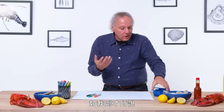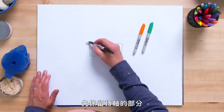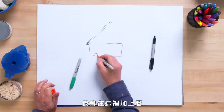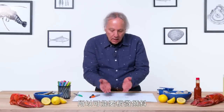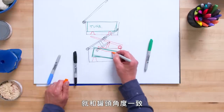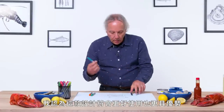Time to redesign. This doesn't give any mechanical advantage at all — you're still pushing with one or two thumbs. I would try something different: keep the hinge but design some feet to raise the can off the floor, so you can use your weight to press down on the tuna can. The water level would rise, so the design would need to be tilted. Put the hinge so that when the plunger comes down it is at the same angle as the can — that allows a palm press on top, and the liquid pools up to one side. That gives you more power and a mechanical advantage.